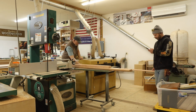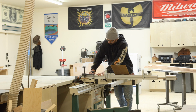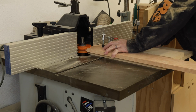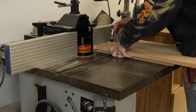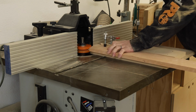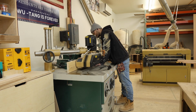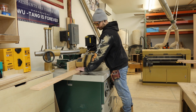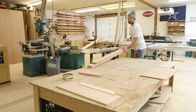And I ran everything through the sander now because I'm not going to be able to run it through the sander after I glue this thing up, because it is pretty big, this panel. Go through our standard procedure here, just coping. We've got one center stile and then a top and bottom rail, getting those coped, and then run the groove on the other shaper. All right, and then those parts were ready.